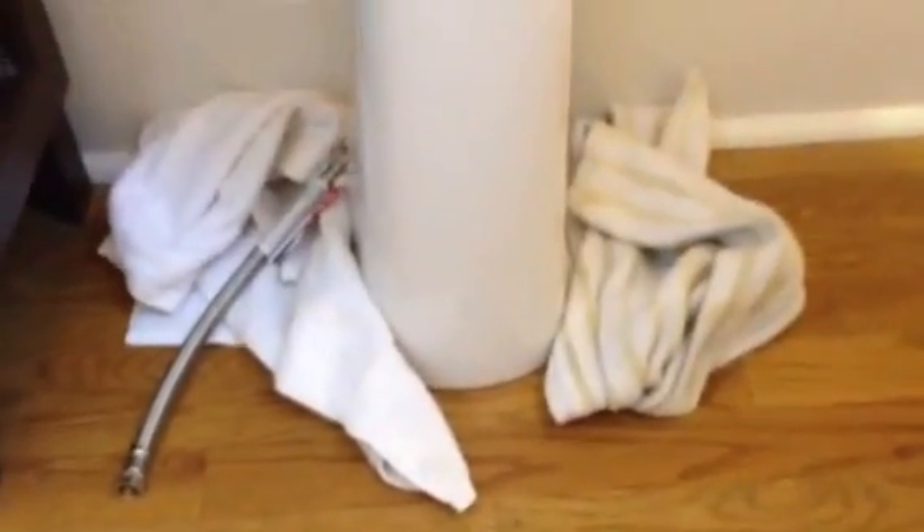Take that off and always make sure you put some towels or rags down — you're going to get some water. The water in the line will come out and get all over your floor if you don't. When you get that nut up here coming off the faucet, it'll drop down and then you just pull it off. Make sure the water line is completely turned off, unscrew the bottom connection, and slide out the water line. Just make sure both connections are completely unscrewed before you do that and the water line is shut off.